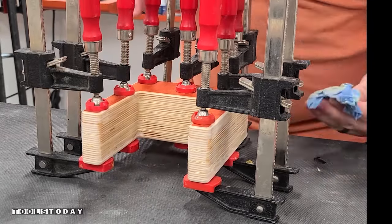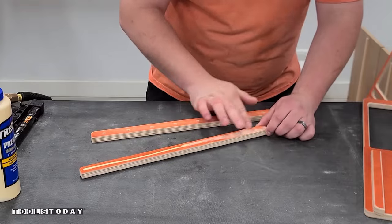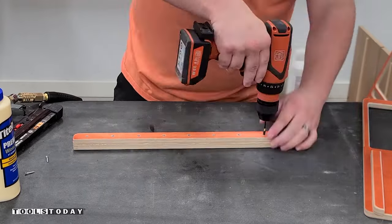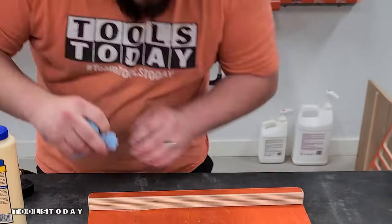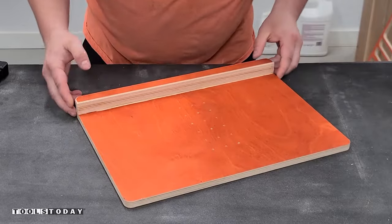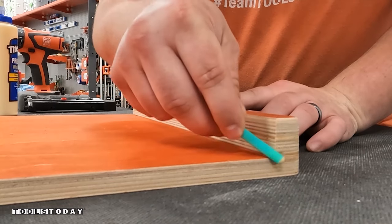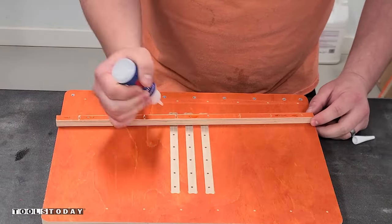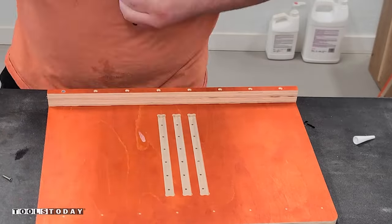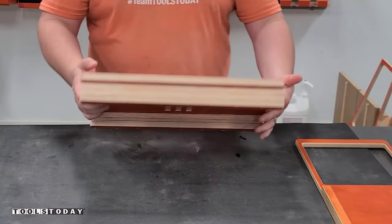I cleaned up a little bit of squeeze out with just some water to limit the amount of glue squeeze out to deal with later on. I used clamps for some of these pieces, and for others I'm using a pin nailer to temporarily hold things together, then using those screw holes we drilled to get everything screwed together without clamps. The glue holds long term; the screws are basically there just to make sure everything dries quickly. One quick tip: if you use a straw, it works super well for cleaning out glue squeeze out in really tight corners. I'm also using Starbond medium CA glue here to help with assembling — it dries quite a bit quicker and holds a little bit stronger temporarily, and then the screws do all the long-term holding.